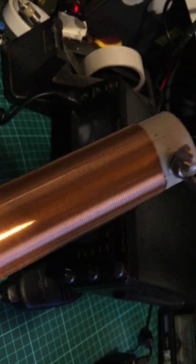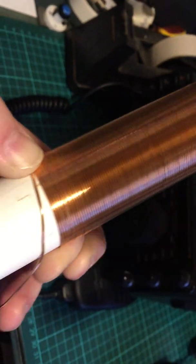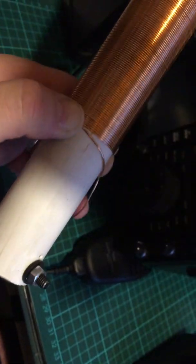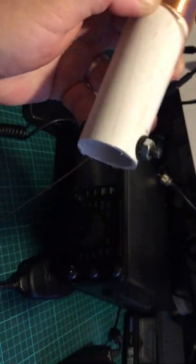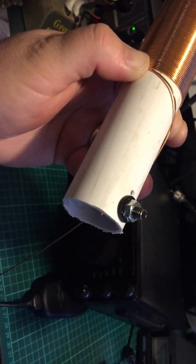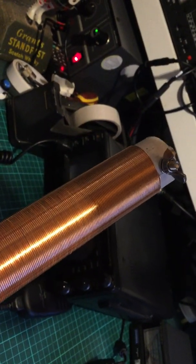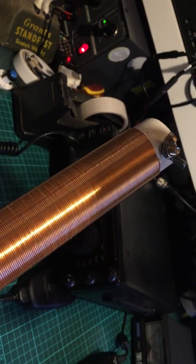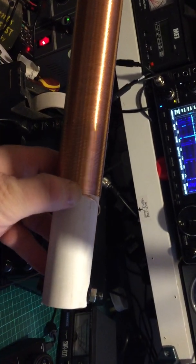It's about 260 turns of one millimetre wire. We did see it online — somebody had made one. I've got a half wave end fed antenna with one millimetre coil wire. It only covers 40 metres up to 10 metres, so I'm going to put this coil on the end of it and get into the 80 metre band — have a bit of fun on there hopefully. Looking forward to it actually.